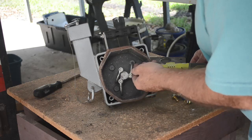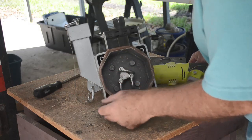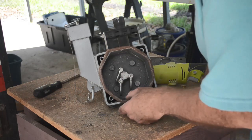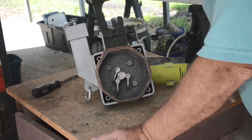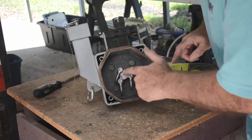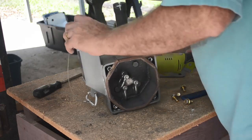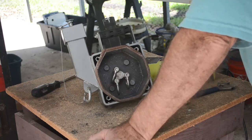Yeah, the hammers are good and warm. They don't really look any more worn than they did before I started. The hard quartz I've been crushing and the ceramic IC chips have got the leading edges all pitted. But they are still solid looking. This process did tear up the gasket on the inside some. But on the whole, the Mighty Mill doesn't really look like it's suffered any damage. I do need to align it - everything's kind of tilted over this way, the shaft coming through is tilted and needs to be centered up. You can see how this hammer is much closer to the edge. I'll put the Mighty Mill back together and work on getting it realigned, everything straight, and tighten it all down again.